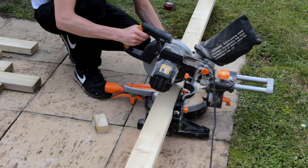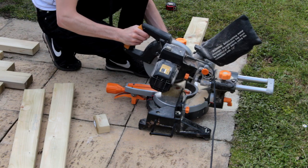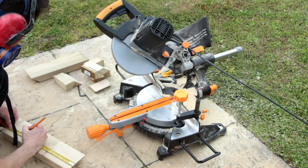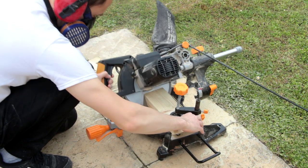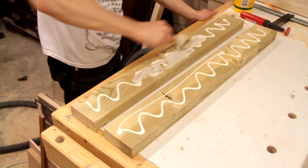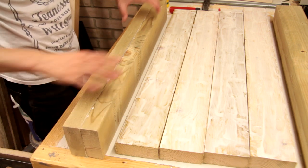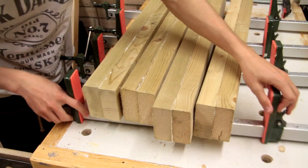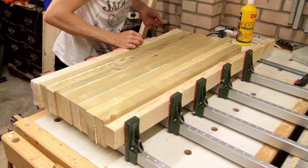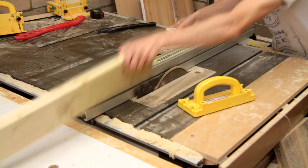For this build we'll be using pressure treated 2x4s or close equivalents, and we'll start by cutting all of the pieces we need. The table will have some corner braces — I'm cutting the ends of those pieces to a 45 degree angle. For each of the legs we'll need to glue two of those 2x4s together. This next step is a bit misguided where I try to clamp them all stacked together — this method would normally be okay with well-planed timber, but 2x4s don't tend to be supplied quite as flat as that, although I made it work in the end. While that's drying, I'm ripping down some pieces so they're slightly thinner, and they'll help to support the tiles, particularly at the center of the table.